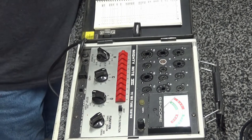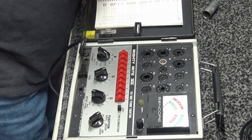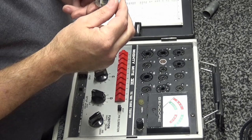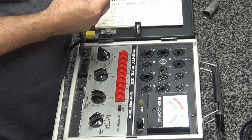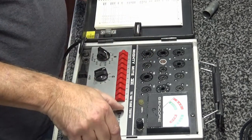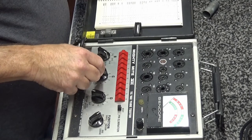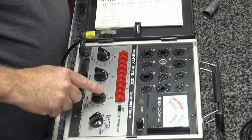Okay, the last thing to do is the detector tube. Just looking inside these coils here, making sure that somebody hasn't been in. Oh, and this is a 12AV6. 12AV6, Alpha Victor 6. This is the detector, the 12AV6. Got actually three sections of this tube. Anyway, the filament's going to be 12 volts, that's what the 12 stands for in the tube. And the series is going to be A, and then C, which is the load, will be F. And then D is setup, still in one, and then socket number 4.